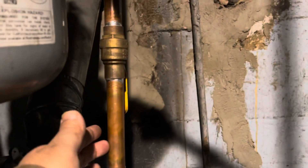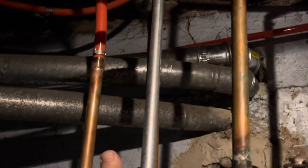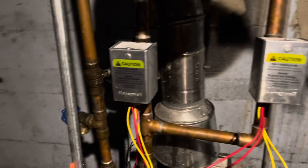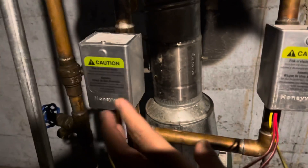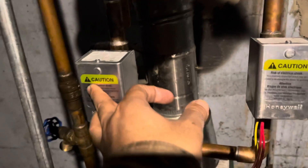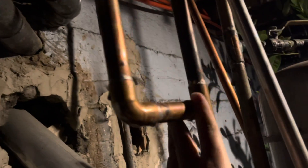The living room return — the flow starts here and it's going to be controlled by this zone valve. It started from here, went around, and came back here. Each zone valve is going to have one flow and one return, and both are going to be connected on the same line. This flow line connects through a tee so it flows individually. The zone return connects with the pump — this is the return line and both of them have to be on the same return.